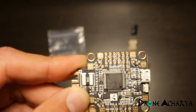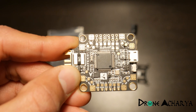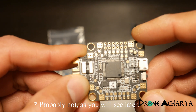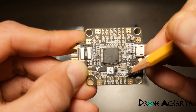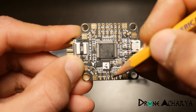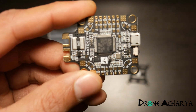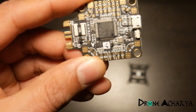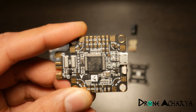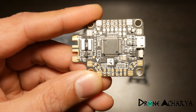What this means is you can connect your VTX and turn it on whenever you want. If you're on a field with other people flying around, you can plug in your battery and the VTX won't turn on by default. Just flip a switch and the VTX turns on. The C1 and C2 pins support two cameras, so if you're building a cheater quad with one FPV camera looking forward and one looking back — where you can switch direction with a flip of a switch — or if you're into 3D flying, this is a perfect board for you.